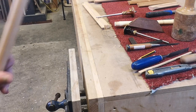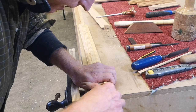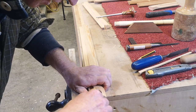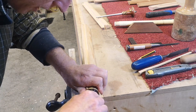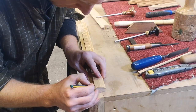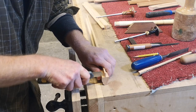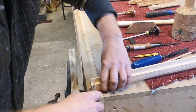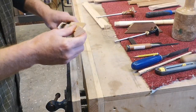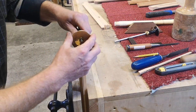Let's get it marked out and have a little look. So one of the first bits you mark out is 8mm deep. This section I'm marking out now will be taken out on the mortiser with a 6mm bit. So that's that piece marked out. Secondly, we'll mark out our 6mm tenon.